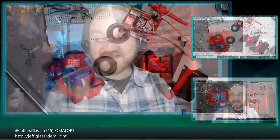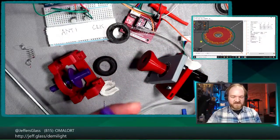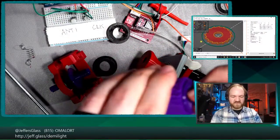So what you need is not so much a cleaner. Getting rid of the oils on the bed is always a good thing, but what you really want is a separation agent, so that the PETG actually releases from the print bed successfully. So that's what the Windex provides. That's a thin layer of slight chemical buildup that allows you to successfully get the PETG parts off the bed. Anyway, that's the theory. Like I say, I haven't really played around with it, but that's the advice from the internet that I've been following, and it seems to have worked all right.